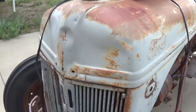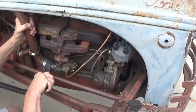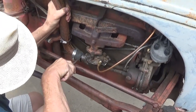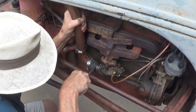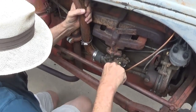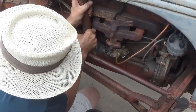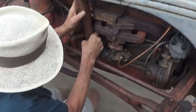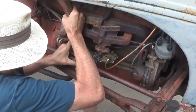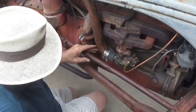We're putting the carburetor back on. We cleaned it out and made a gasket out of a piece of gasket material. You want to smear a little grease around the outside of that? It should go. There we go. Now remember, one of us has to bleed and wipe our blood on the tractor part — and it's your tractor, so it's your obligation.